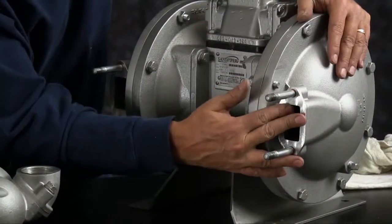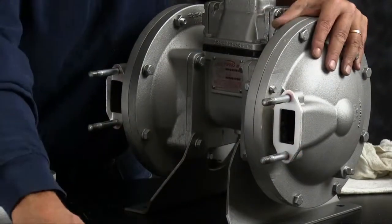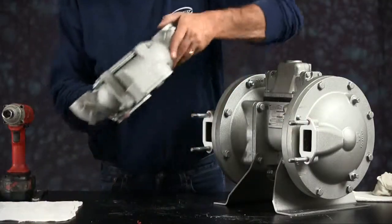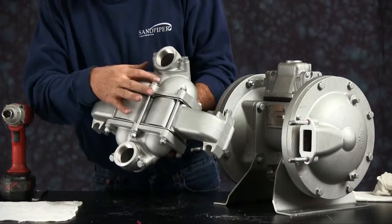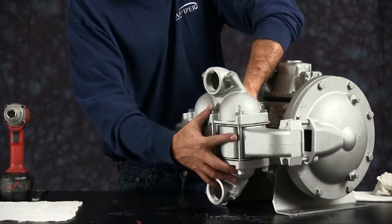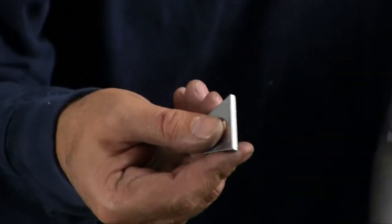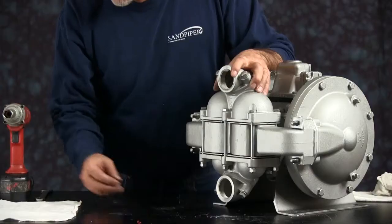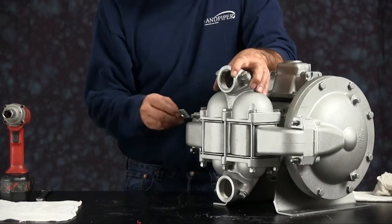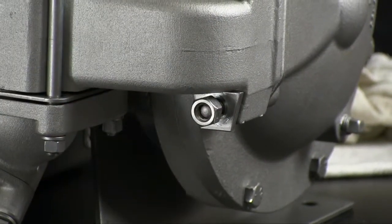You want to install the gaskets on the ports of the outer chambers. Set our manifold assembly up. Make sure that you have the suction and discharge ports in the right direction, in and out marked respectively, and the suction side needs to be on the bottom. Take the retainer wedge — the entry face of the wedge needs to be pointed towards the chamber. Install the nuts; these are lock nuts. Tighten in a crossing pattern.